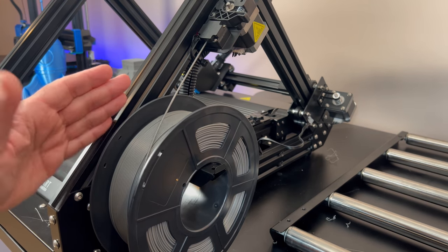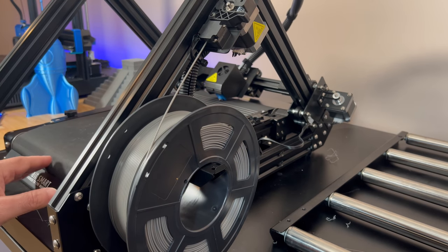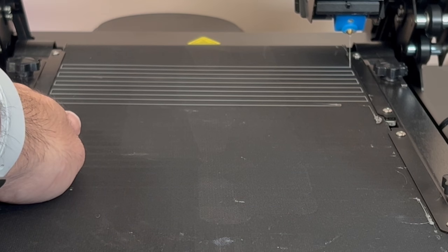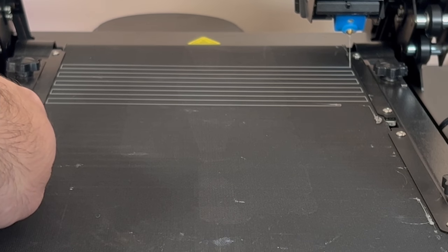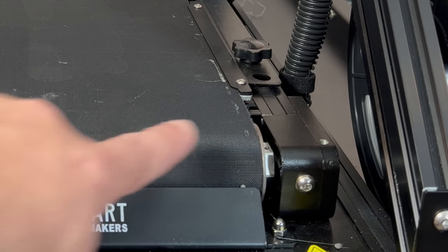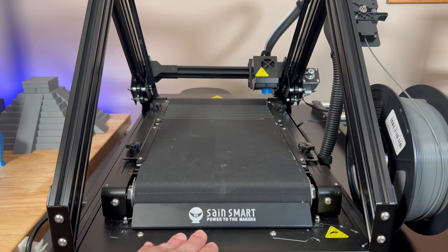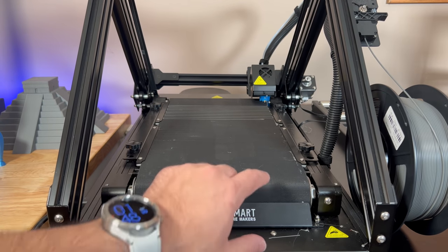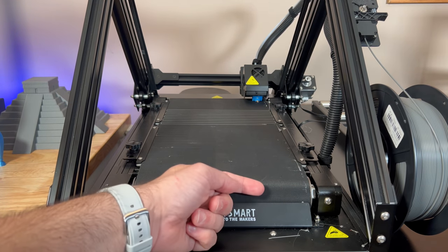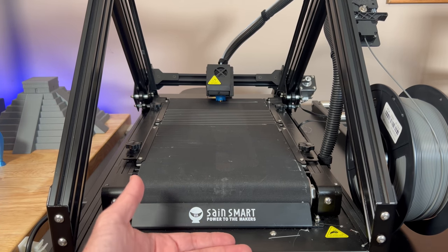Comparing this to the CR30, you'll see how much smaller the footprint is, but when you measure the actual print surface, they're very similar. In the front of the printer, the belt area is your print surface — you can see the layer test showing what area you have to print, which is a nice working area. On each side you'll find screws where you attach the rollers, which extends it forward for large prints. As the belt rotates, you can see it moving forward during the layer test, and without the roller extension, prints will just pop off the edge into a catch bin.